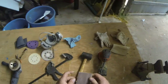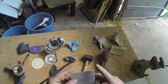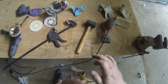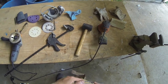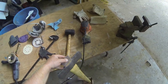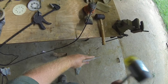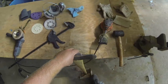All right, so just made this wedge out of a piece of walnut. Just took me, I don't know, 10 minutes to make it. Fit it in there. I'll bead it down in there, and then we'll put our little wedges, our little keepers in there, and put some boiled linseed oil on it, some kind of oil, and call it good. Looks like it's seated pretty good.